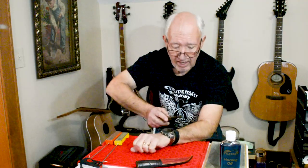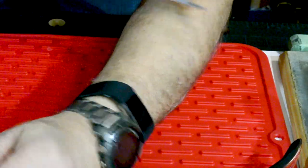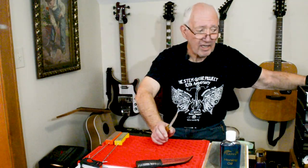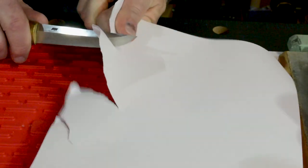How do I know this knife needs to be sharpened? Two tests. One is the shaving test — I'm going to drag the blade over my hair-covered arm, and I am not getting a single bit of hair off of there. The next is the paper whittling test. With a good sharp knife I should be able to easily slice off thin curly wafers of paper, but with this knife I'm mostly just tearing the paper.